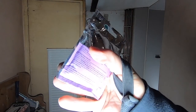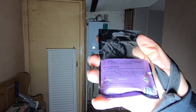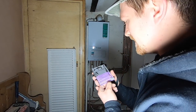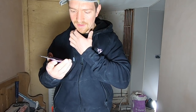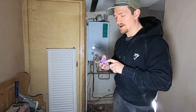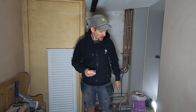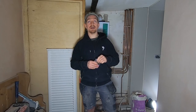Half Time. And the instructions state, you won't be able to read that, but basically it's 7 litres of water for pink plaster or 5 litres of water for grey plaster and approximately half a bag of bonding. So I've got about a third of a bag's worth here. I've got this bit to do, a few bits around there.